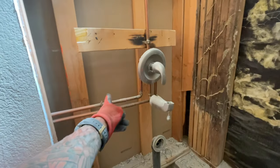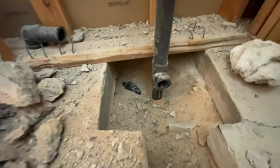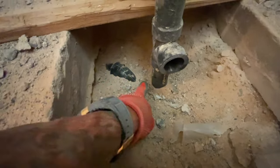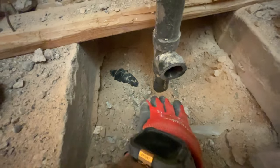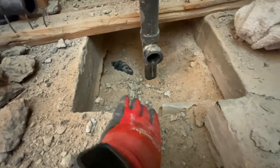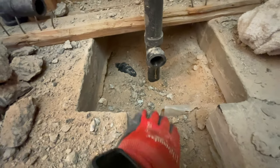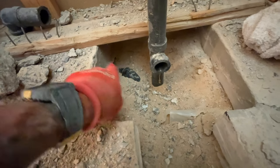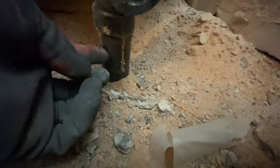This will all be finished to here and we'll have a riser. The next thing will be to cut these out and transition over from copper to PEX and put in the new fittings. One important thing is that I don't want to cut this pipe below where the top of the P-trap is coming out. If I were to set my runner lower than that, we'd have water that would sit there — the P-trap would still work but you'd have some water sitting there. So I want to make sure everything drains down into the P-trap and goes out. I'm going to cut this just below the knuckle, clean up the pipe, and then the elbow comes up.